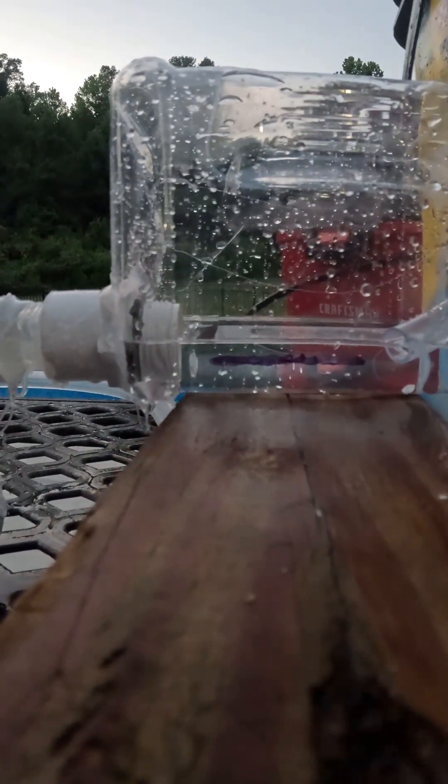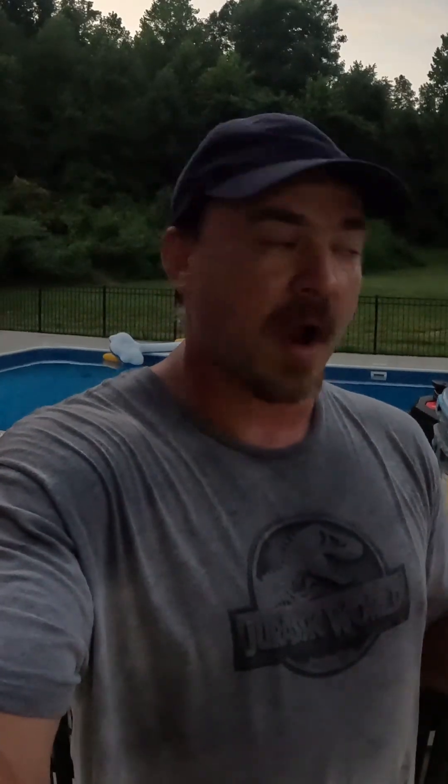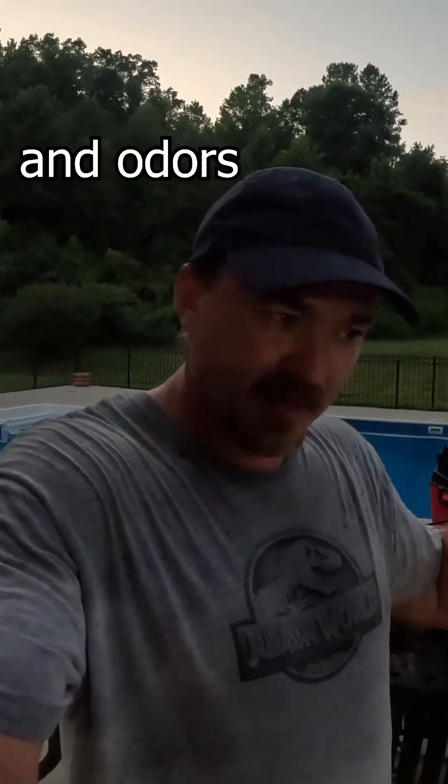Hopefully that was a good visual for you guys to understand why traps are so important, how they work, and why they're there. Be careful of your placement on your vent. On gas furnaces your drain and your coil are going to be on the positive pressure side, so the air is actually helping push it out — you don't have to trap those. You can still trap those if nothing else; when the furnace isn't running it'll stop any outside bugs or anything from climbing in the drain and getting inside.